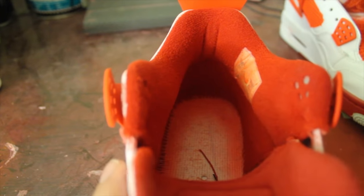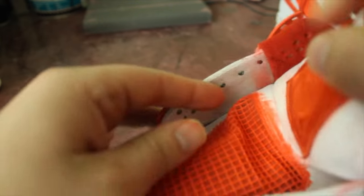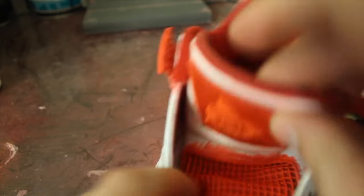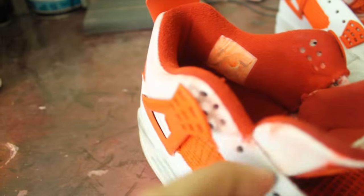All right, guys, and here's what one coat looks like, or one pass, if you will. I didn't worry about this. We'll get this, and we will get the sides and all of this later. We're just going to focus on this back. It's been about 4 or 5 hours, and this is dry to the touch. It's still soft, good to go. I'm going to go ahead and hit that with another coat. Just want to show you what one should look like.